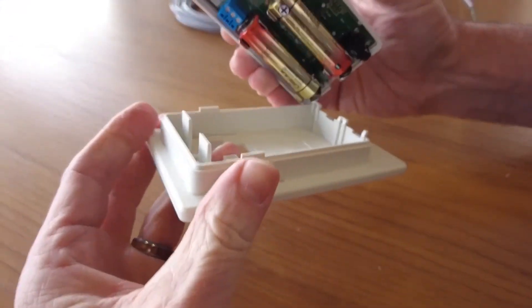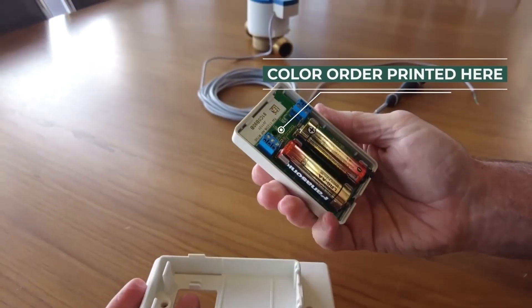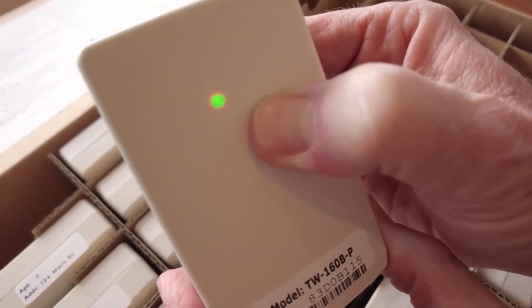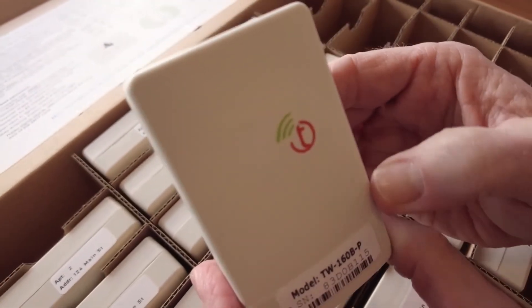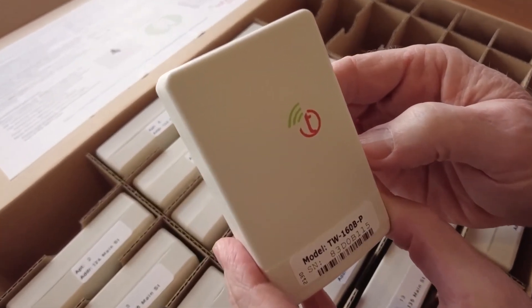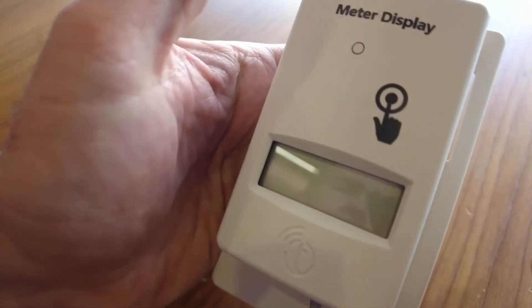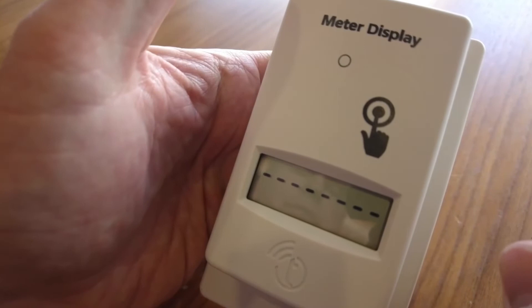The wiring colors used most by encoded meters is printed on the green MDT circuit board above the battery. Once a meter is connected, tapping the MDT button will force a transmission to the DCAP as well as provide feedback about the state of the MDT as was discussed earlier. The forced transmission is useful for testing the meter and MDT connection.